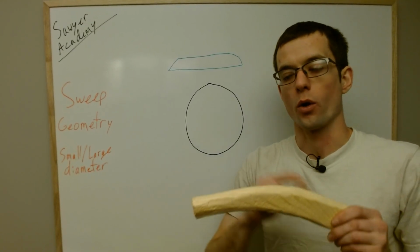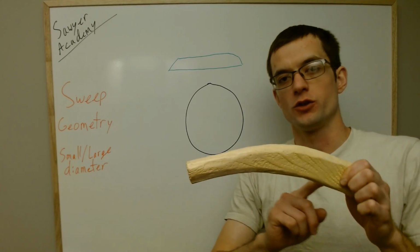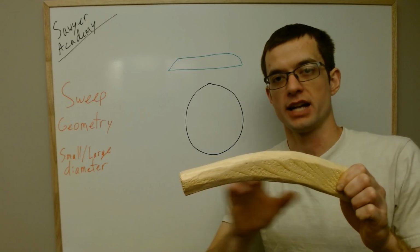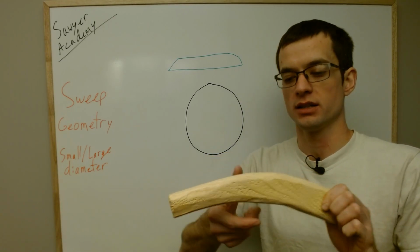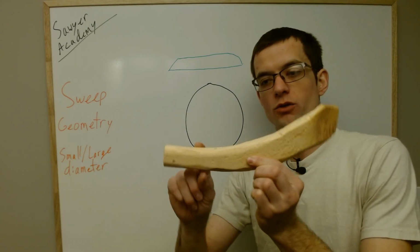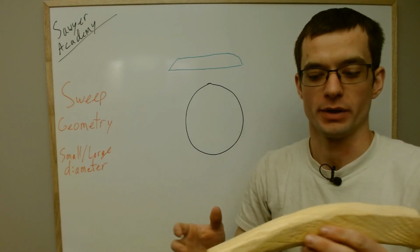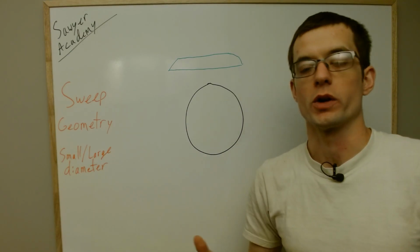to end up with horns down. And why you always go horns down in a scrag sawmill is so that you have 2 points of contact as the log goes through your saws. If you were to process the log belly down, the log would literally rock as it goes through the cutting tools. So you always want to go horns down in a scrag sawmill. So now how does that apply to portable sawmills?